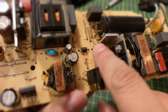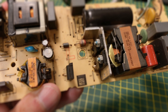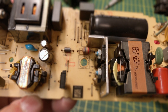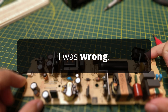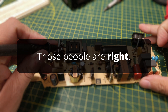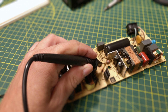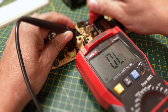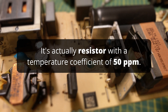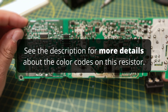It looks like this resistor right here is bad. There seems to be some debate on the internet about what value that is, and if I read those codes it says it's supposed to be 16.8. Some people are saying it's supposed to be 0.168 or 168 milli-ohms. I'm gonna go by my inspection and say that it is 16.8, and right now there's no connection at all — it is not continuous. That's just a plain old resistor that isn't supposed to be open, and this power supply has no 5 volts on the 5 volt rail.